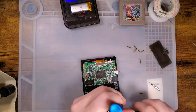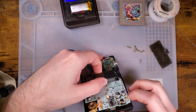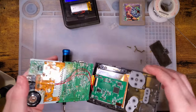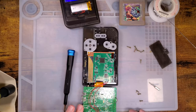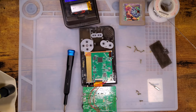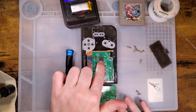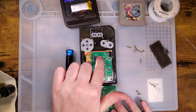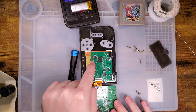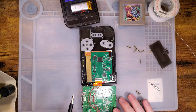Let's get this thing torn down a little bit more. I can't lift that up because I never stuck down my backlight mod and now it's stuck. I wanted to do this Game Boy specifically because it already has a handful of mods, but also because it's the one that has this specific backlight kit — this mod only works for this backlight kit. The Game Boy sends its screen data over this cable straight into this FPGA right here. The FPGA works the magic, it comes out here and goes to the LCD. What we're doing is hijacking this chip that interfaces into the FPGA but doesn't go straight into the Game Boy itself. We're changing the code on this chip, and that should give us a better OSD experience.